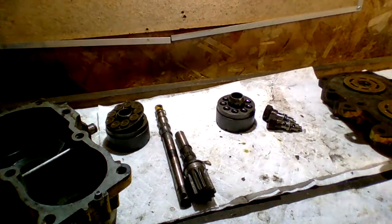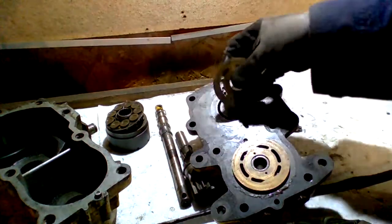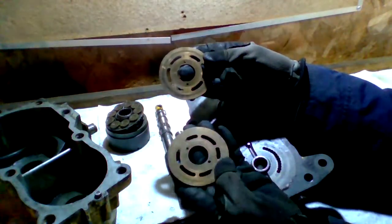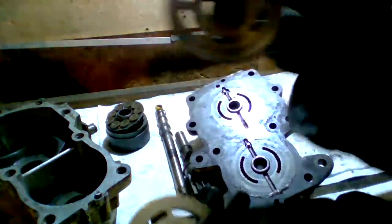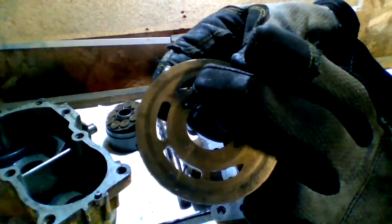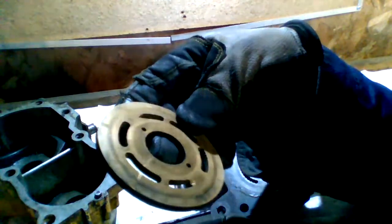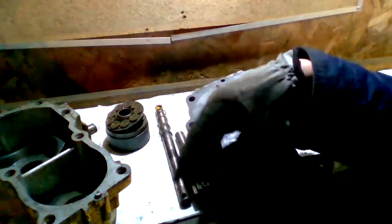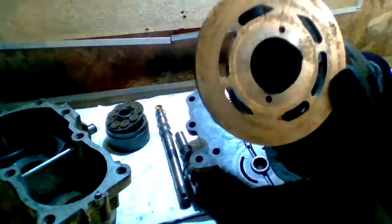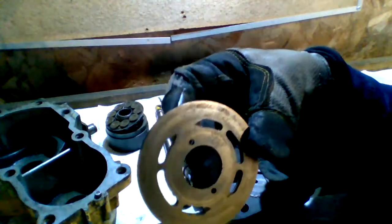I don't know the specifics on exactly how the fluid flows through. But if we take a look at this cast iron portion, there are these two different brass plates. This is the pump one up here, and then this is the motor one. There is a key difference between these two plates. On the pump plate, on the edge of each slot, there's a little cutout area, and there's another one opposite of it — those are important for fluid flow. The key is there are two of them on the pump plate. But on the motor plate, there are four: one on this slot, one on this slot, and then two more on the bottom ones. The reason is two of them are for forward and the other two are for reverse, because there are two different directions that the fluid is coming from.